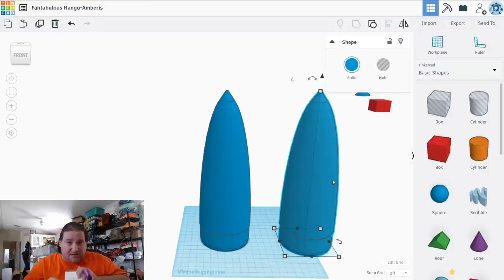By stopping short of the outside surface, it can now draw from outside to inside, and then from inside almost to the outside, back to the inside again, continue around, almost to the outside, back to the inside again, continue around. So we need to make a cut tool that's going to cut slots between the two surfaces, but that doesn't touch the outside surface. How far off? Number one, it has to be precise through the entire object. You can go less and no problem, but then the rib won't actually touch the outside surface. And if the rib doesn't touch the outside surface, you don't get the connection. You don't get the strength increase.